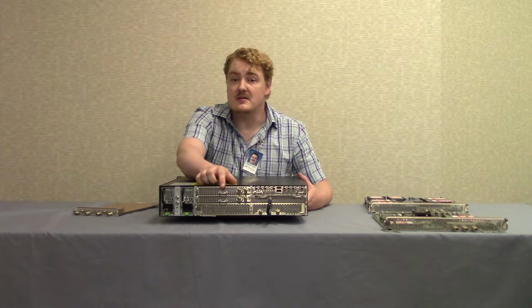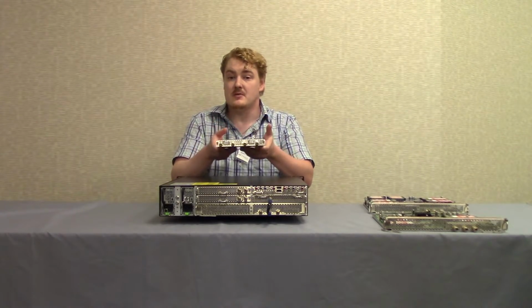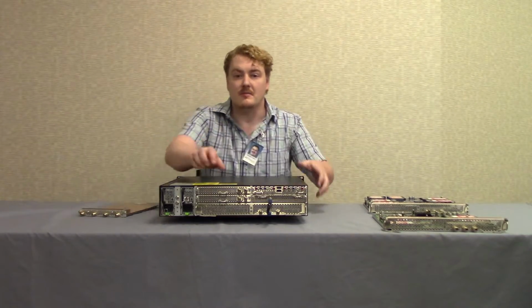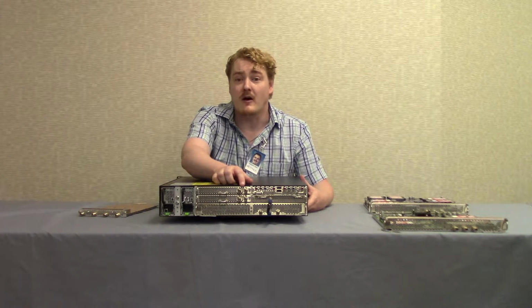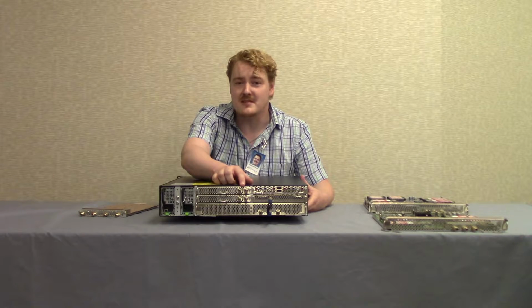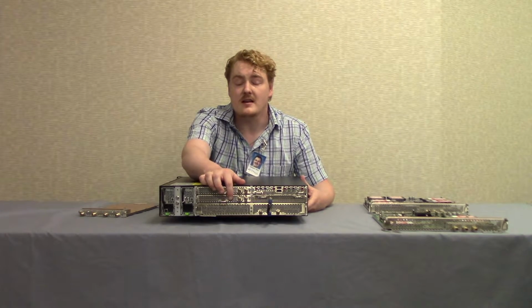The difference between the TQ1030 Plus board and the TQ1020D Plus board is that the TQ1020D Plus board has 4 RF ports, whereas the TQ1030 Plus board only has the 1 RF port and 1 RF test port. Like the TQ1030 Plus board, the TQ1035 Plus board only has the 1 RF port and 1 RF test port. Unlike the TQ1030 Plus board, the TQ1035 Plus board has the additional benefit of being able to do MPEG-4 to MPEG-2 transcoding. Beneath this is an additional slot that can be used for an additional RF output board.